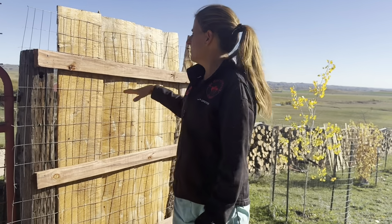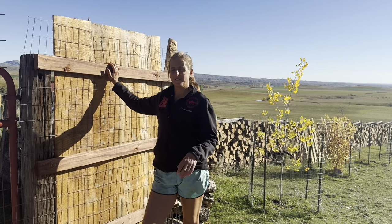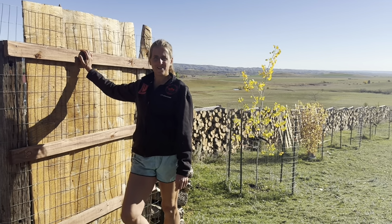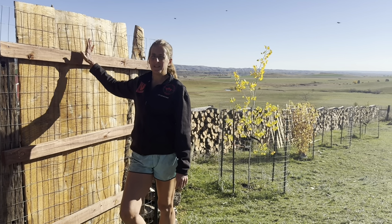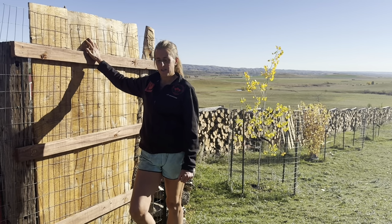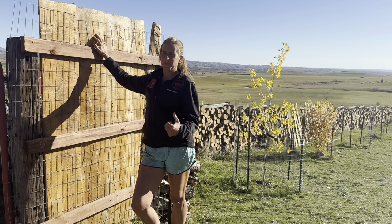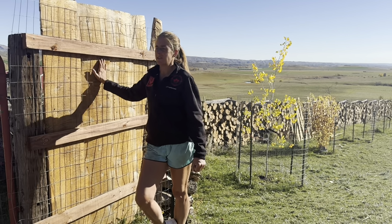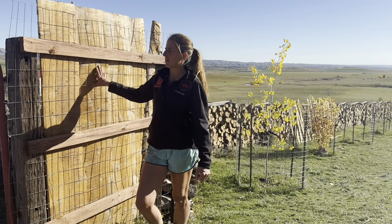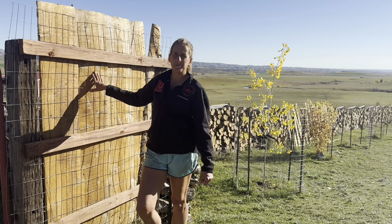And what I'm gonna do is before winter, well, winter, we're on borrowed time here. We're getting mid-October, end of October, and we've just had bonus time this year to get a lot of outdoor work done. And I'm gonna put some linseed oil on it because the first coat was motor oil when I had my truck oil changed. I just said, could I please keep the old oil? I wanna reuse it and repurpose it one more time. And that's what I used to stain it. But this year I'll do linseed oil because I also don't want it to keep getting darker. I really like the color and the linseed oil won't really darken it up.